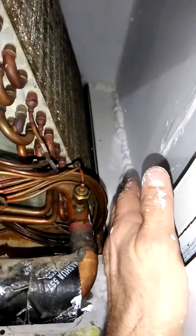But you can see in here, I've gone through and sealed up against the wall from the sheet metal casing on the Intertherm to the wall. Sealed that up. I painted everything with Kilz. There's no air infiltration at all that's possible in here. Actually sealed back here too, so it's airtight.